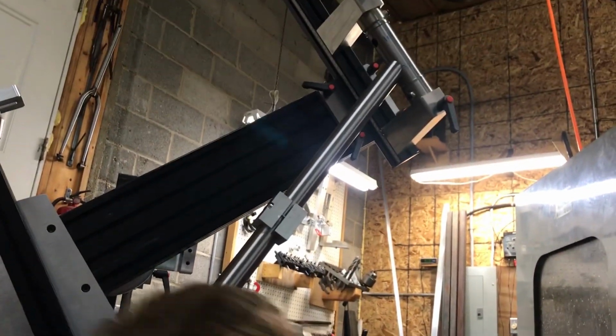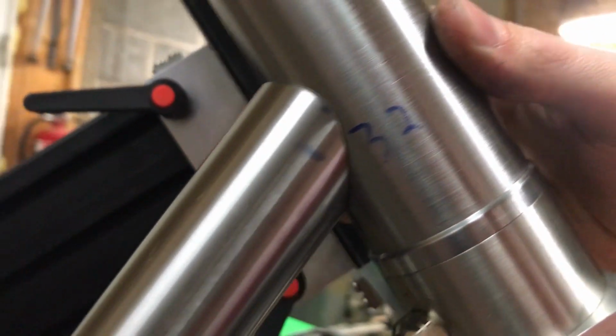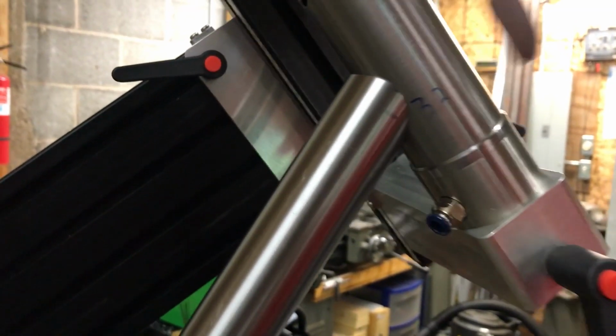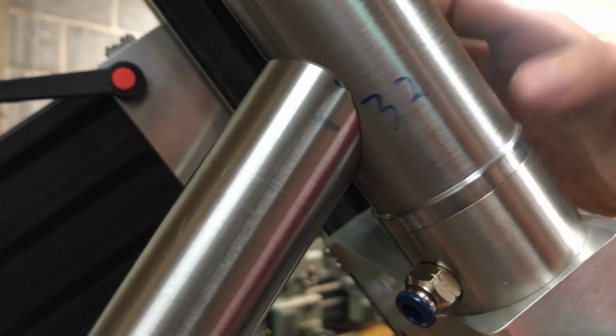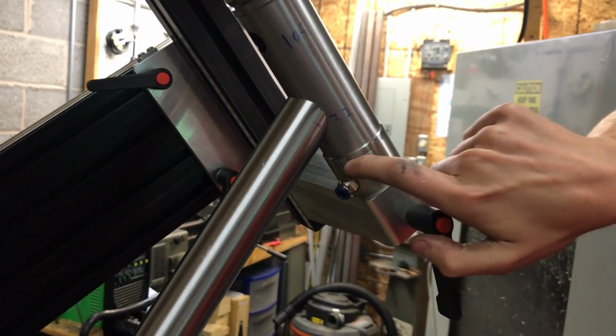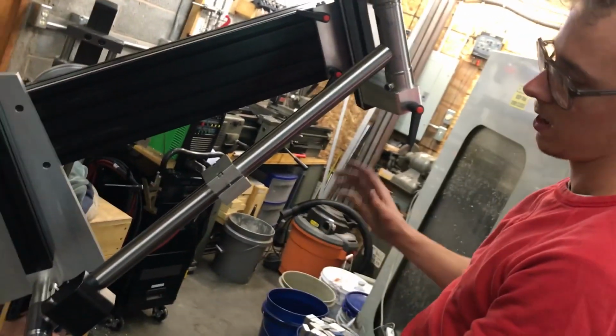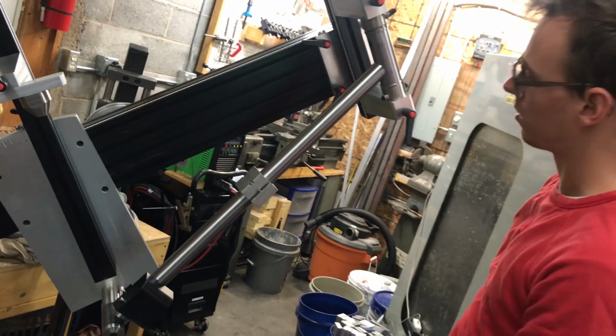And my miter down here is looking pretty decent. And as you would expect, it is sitting high on the head tube because I cut it long. As I trim that down a little bit, this will come lower. So I think I'm going to take a measurement from the bottom of the tube here to the top of this head tube puck, and we'll see where we're at there. And then I'll just take another successive little cut again.